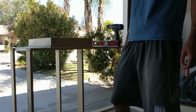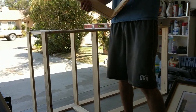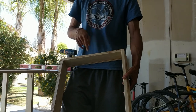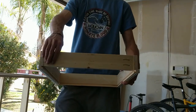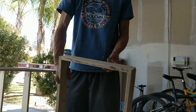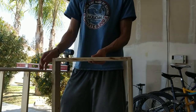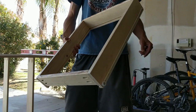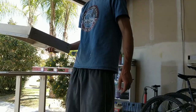For the frame I did about one inch shorter than the total length of the cabinet — so 20 inches. I did the sides the full length and then did the front and back on the inside. I used pocket screws on the back side so you'll never be able to see those to attach the back and the front. Same thing on the front, but we'll be putting a false front on here to do the trim work and make it look good, so this will all be covered up. When you look on the inside of the drawer it'll look nice with no screw holes. It's very solid so I think it'll handle moving around in the van pretty well.